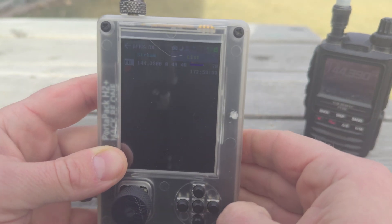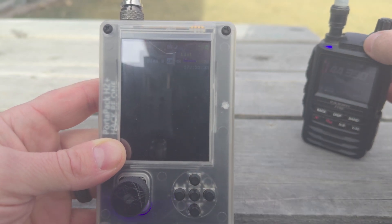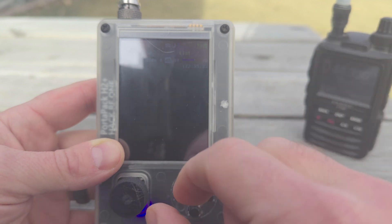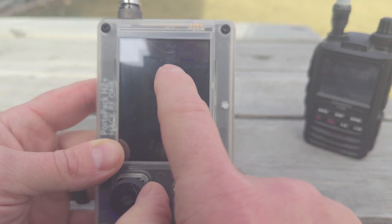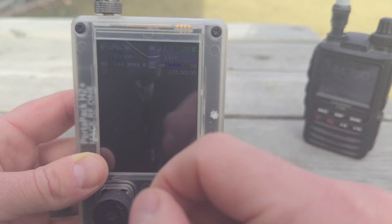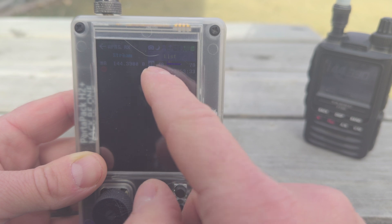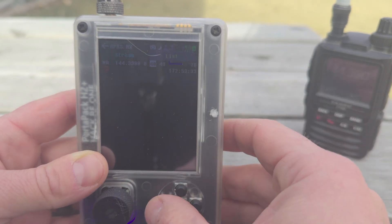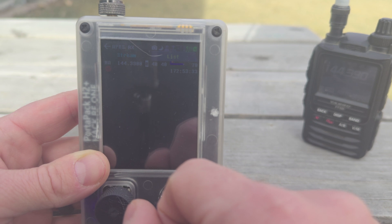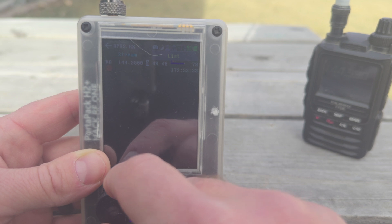A few things to check out off the bat if you're not getting APRS coming through: check your VGA and LNA. The 40 and 40 up here - make sure that those are at 40, or at least 36 and up. I did drop these down the other day to 8 to 16, then went up from there to see where I would start getting signal. It wasn't until around 32 or so that I started getting full signal. You could try your gain right here at zero to see if that's an issue, or put it at one. If you're not getting anything, put it back at zero.